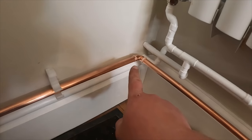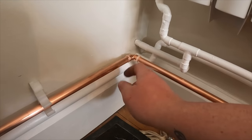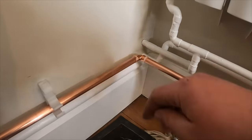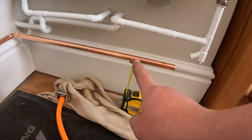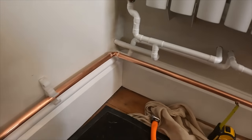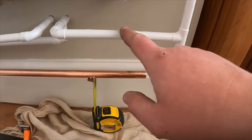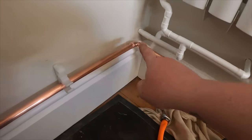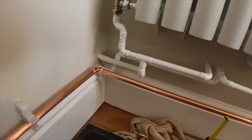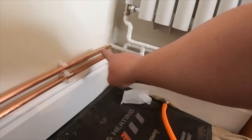That valve's connected and the pipework run down, so we're now concentrating in this area. Another little trick I've showed you before - just crimping or pinching the end of an elbow or fitting to save the pipe moving around. There's also this little gem: just set your tape measure up, hold the pipe up, get it level, and then you can just solder it into the corner. I'll get this bit soldered up and then when ready to drain down, I'll cut a tee in here for this side.